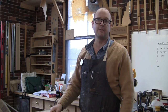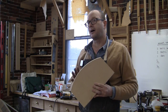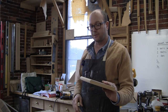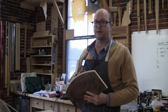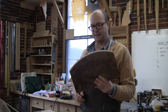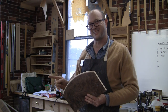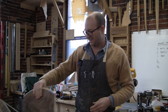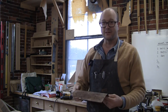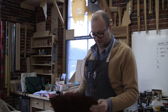The other technique I want to introduce is hammer veneering with a PVA glue and a hot iron, which is a pretty great technique for flat work but is especially useful for curved stuff. In particular, you can use it for a little bit of compound curve veneering. We're going to try to veneer around this bullnose edge — a 12-inch radius with a 24-inch top. We'll use a walnut burl, which tends to be the stretchiest — there's a reason Rolls-Royce interiors are made of walnut burl.